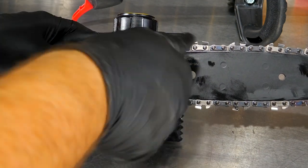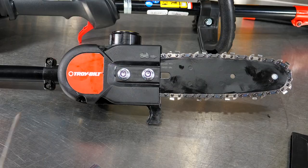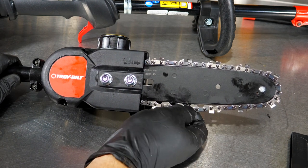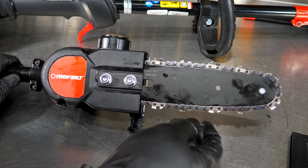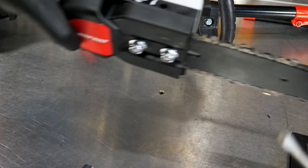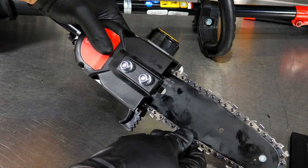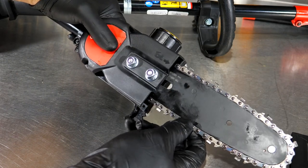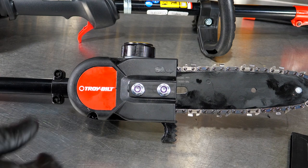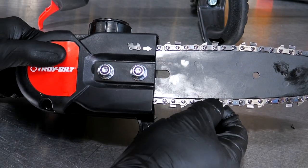Get these nuts on here snug but not tight — you should still be able to move that bar just a little bit. Normally when I tighten a chainsaw chain, I'd tighten it until I could pull on the chain and see kind of the top of the guide tooth. But on a short bar like this, that's really not enough — it will loosen up really quickly. So I'm going to tighten this screw until I've got some good tension on that chain where I really can't pull much on it. With a decent tug I can kind of see a gap, but not much. Now I can tighten up these nuts. Our chain should be ready to go — not too much tension, but just enough where we can see a little gap.